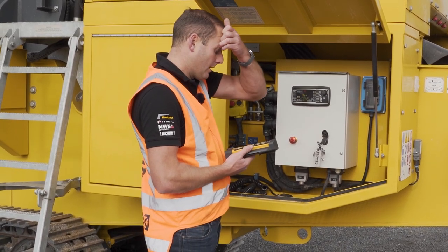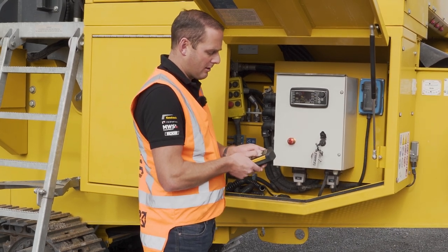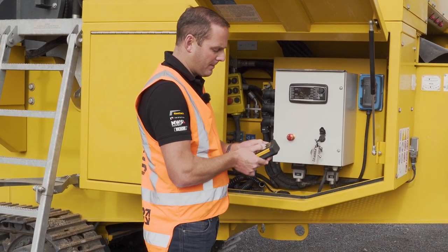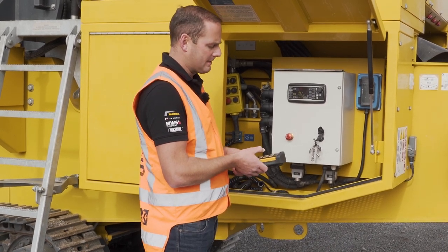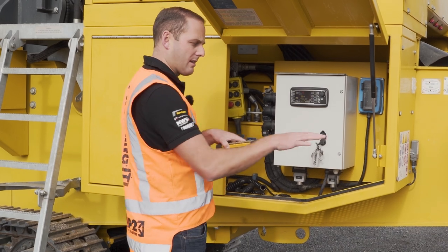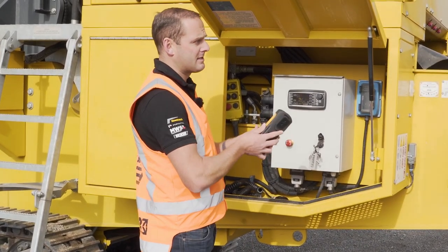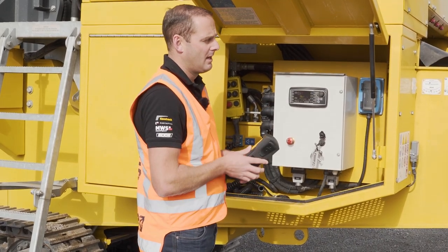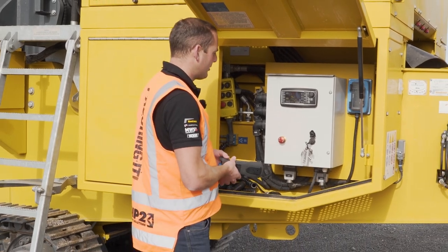It also means that we can track the machine while in operation. While it's running, we liven up the tracks on the two top buttons, hold that for 10 seconds — which is a safety feature. Once it's live, we can track the machine forward or back, particularly if your loaders aren't keeping up with the finished product. We can just move the jaw back a little bit so we can continue processing.